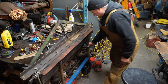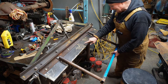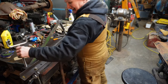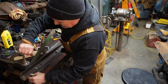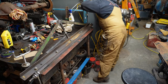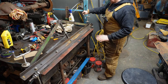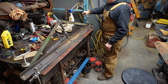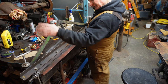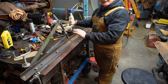I've got a piece of half inch plate that I put on a hinge, and I had to weld it together, and looks like I had four pieces of steel. So we had to weld it together. Got the tensioning bolts go down on the sides. Now, after using this a little bit, I've discovered that maybe I should have designed this just a tad different, because currently I have all of the tensioning hardware pretty much welded in place. You know, this hinges around, and the screw goes in, but all of the threading and everything, it's fixed.